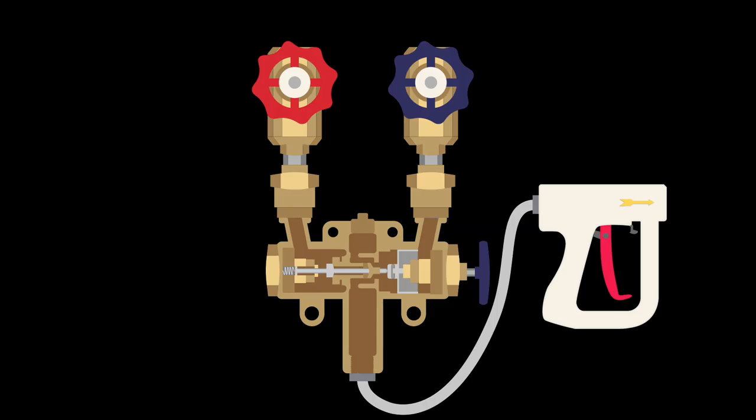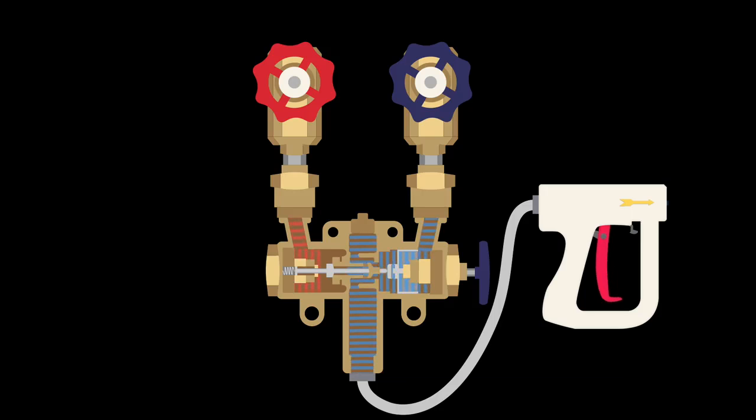the market. To begin operating the unit, open the cold water valve to allow cold water to fill the mixing chamber and hose. Next, turn the red steam valve, allowing steam to enter the steam chamber. In order to prevent live steam from exiting the unit and harming users, 30 psi of cold water is required to push the piston and open the steam poppet.